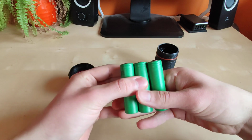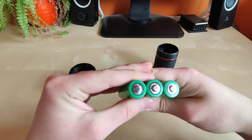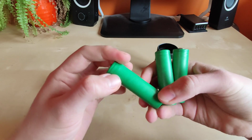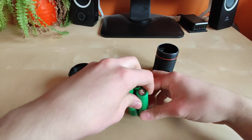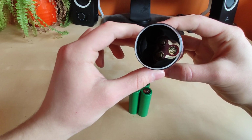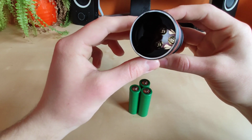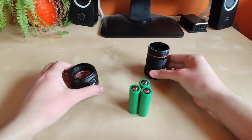So there's just a little bit of a button top on this metal piece attached, so they work just fine. As you can see, I got some chips in this plastic wrap on the border, which would suggest there are some sharp edges inside of the battery tube, but as you can see, there are nice beryllium copper springs in there, so definitely low resistance. They are not doubled because they don't require that, because they are probably the best springs on the market right now, very low resistance and designed for very high current.